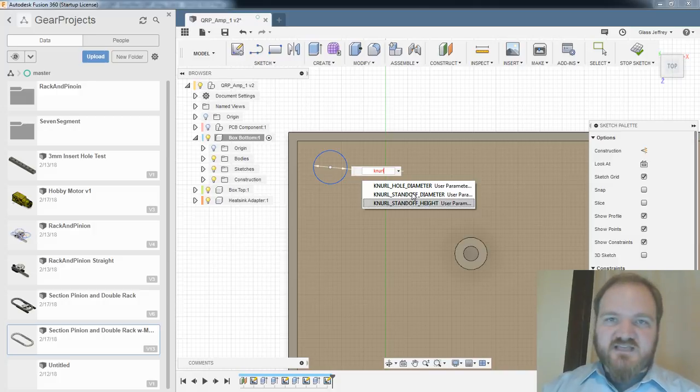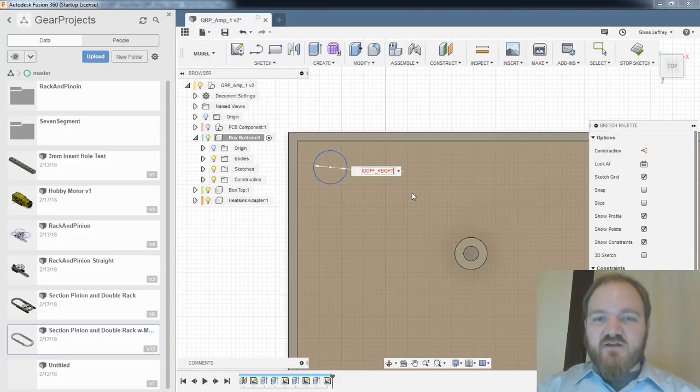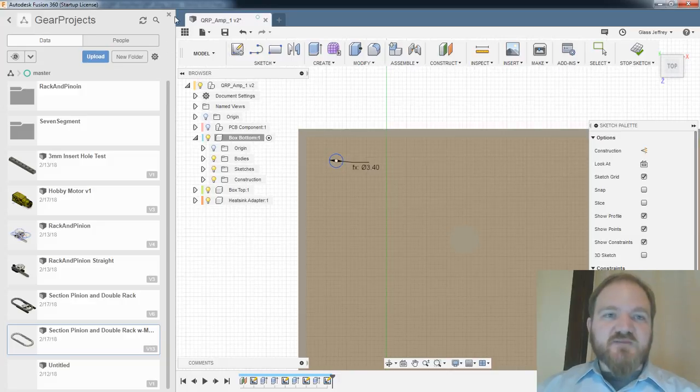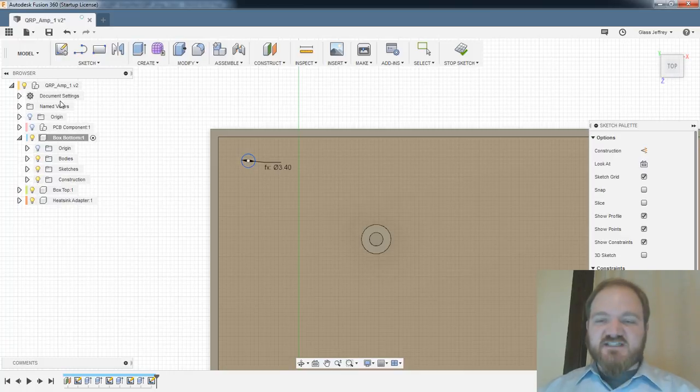The best place to get them is China. You can get a knurled insert tool, which is basically just a pointy soldering iron head, from McMaster-Carr, but it's really expensive, and I don't know exactly why you would do that, when a $15 Radio Shack soldering iron and a cheapy Chinese set of them is the best tool for the job.